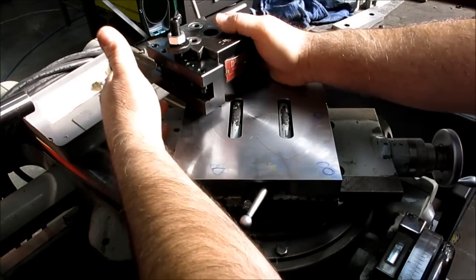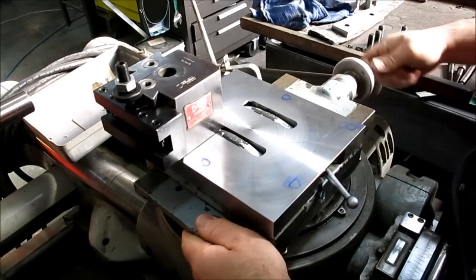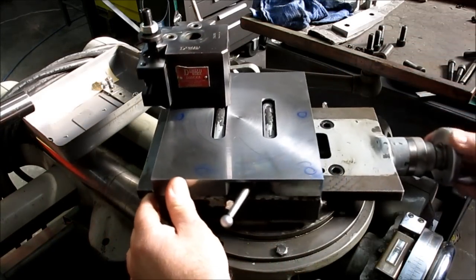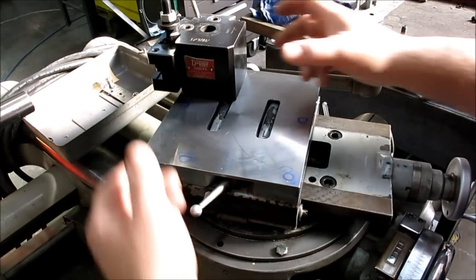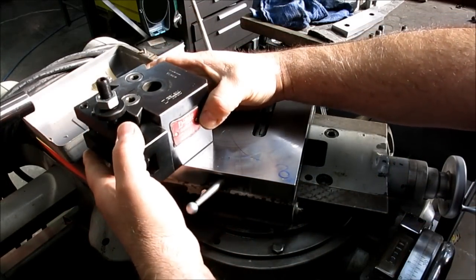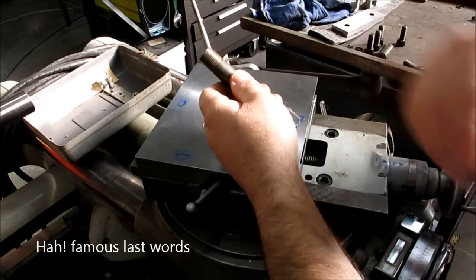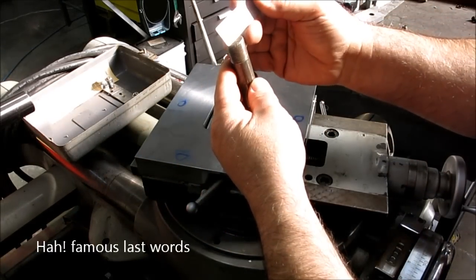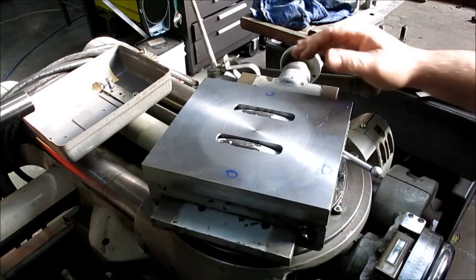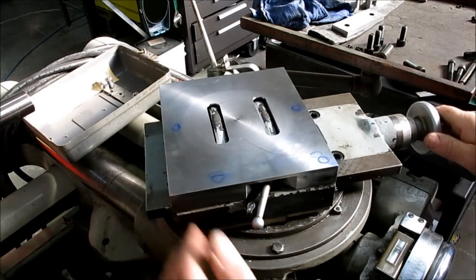I think I want a couple of places here that this thing can be - I can envision it being there pretty easily. And if we swivel around all the way to this side, I could see wanting it over on this side too. It doesn't cost me much to throw some tapped holes in there - three-quarters 16, something like that. So let's go back to the mill and put some counterbores in this thing and get them mounted up.